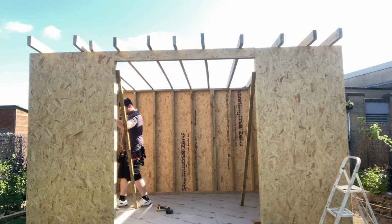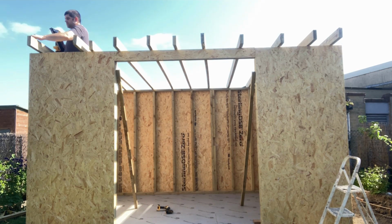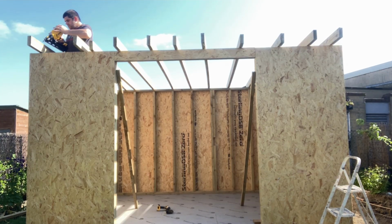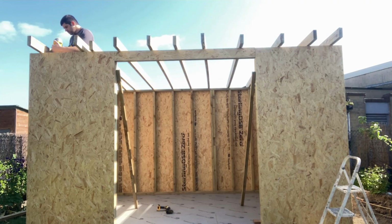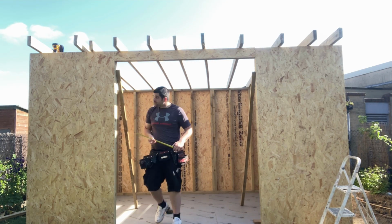And then following that, I'm going to put my battery back in the nail gun, and I'm going to also nail from the top just to get an extra strong fixing. Now I should add all of these joists where possible, so all of the ones on the back and everything on the front that isn't above the lintel is screwed with 2 screws from below to get a really good hold, and then also nailed from the top.